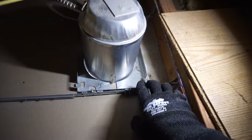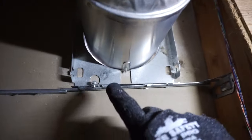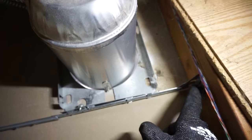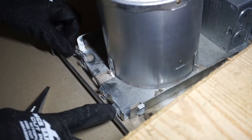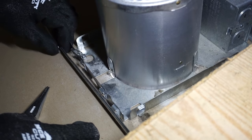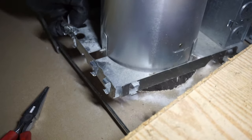This can light is connected by a rail, and this rail is actually holding it in place. There are screws on here — all you gotta do is take out the screw and detach this rail, because we're not going to use this can light anymore. I'm also going to be disconnecting the wire, but first we'll disconnect the rail and take this off. What I did here is disconnected the main source from the rail. After we take this off, I'll disconnect the rail as well. Once you do one side, it should come off on the other rail too.